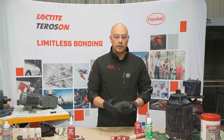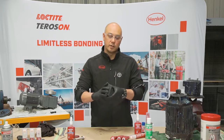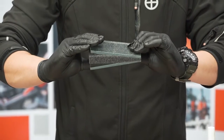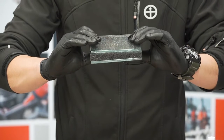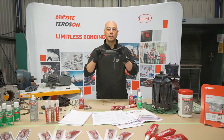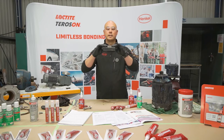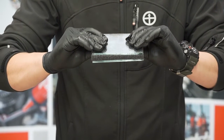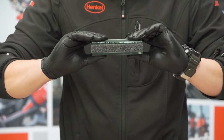What we have here is called a talking gasket, and this demonstrates that if we have uneven pressure on our flange faces, we could potentially introduce a leak path. What we want is consistent pressure so that we have a nice tight fit and no potential for a leak path.